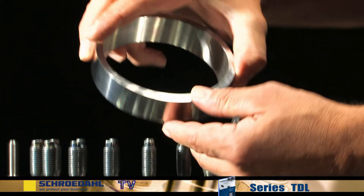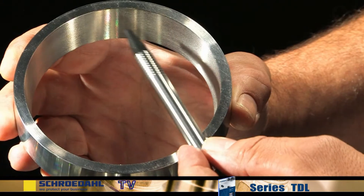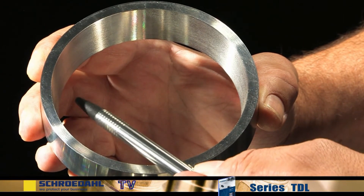If you're using a valve with a Venturi ring, remove the ring and check the inner and outer surfaces for notches, scratches or other damage.